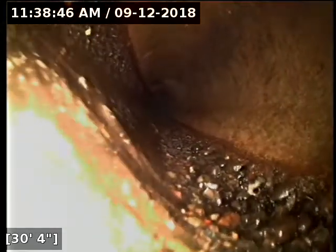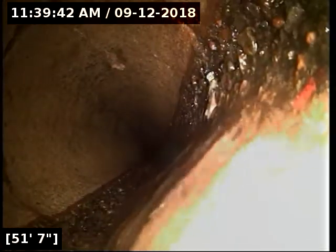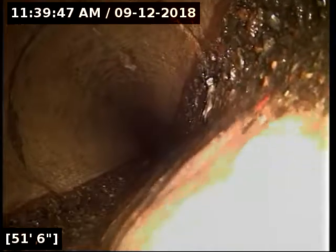And we get a little bit better view here at this joint. You can see that there's a lot of aggregate rock showing through, big chunks of aggregate, but right at these joints here, you can see how it looks like it's opening up to the ground there. That dangling from the top of the pipe, or that joint there, more than likely it's a cobweb. That is not terribly large. Usually roots present themselves a little differently.